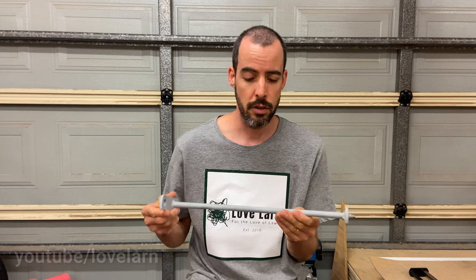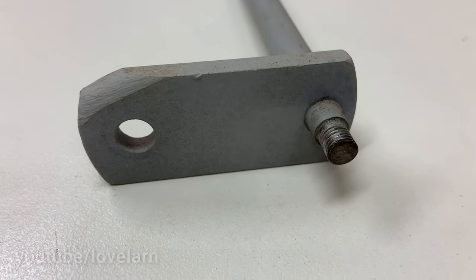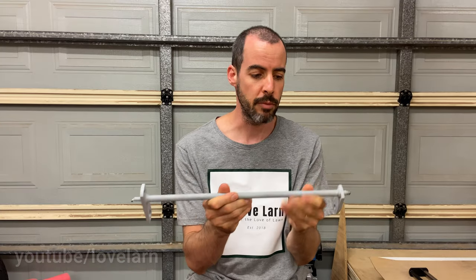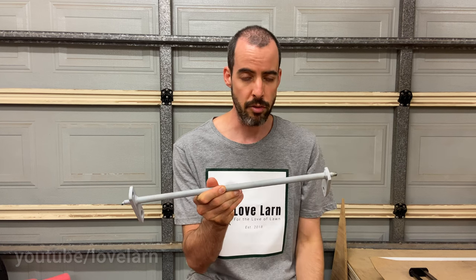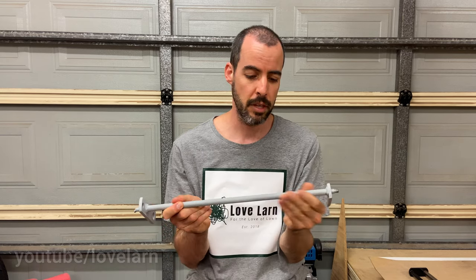This is an old front roller cradle from a 14-inch machine. As you will recall, there are some little shaft ends that protrude through the plate on either end, which are threaded to receive a nut. So you have to insert this into your mower frame by either constructing the frame around it, or spreading the front end of your frame to accommodate inserting these two threaded sections of the connecting shaft. It does make it a little bit harder for those of us who are rebuilding these machines.